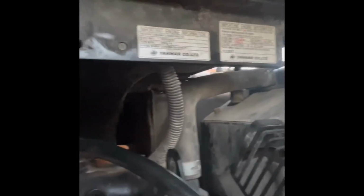Now I've got right at the injector, I don't know if you can see, right there. We gotta do the same thing. Got that one injector cracked open. See if we get the next one. Basically reach back there to that injector. We're just basically working our way through all the fuel lines and getting all the air out.